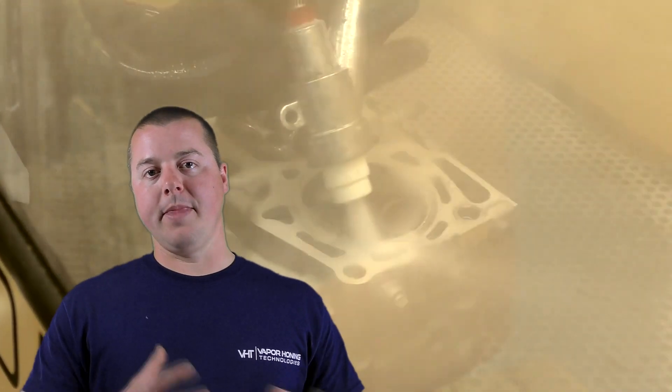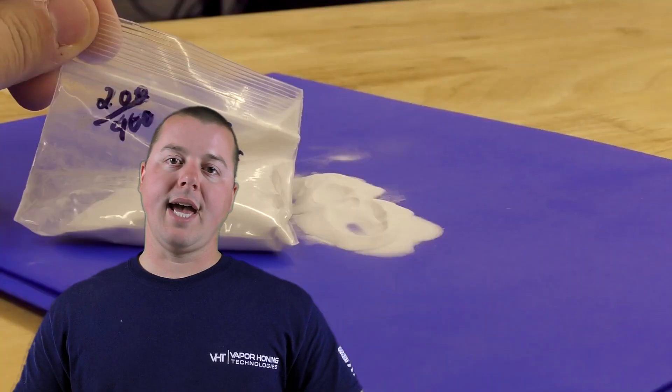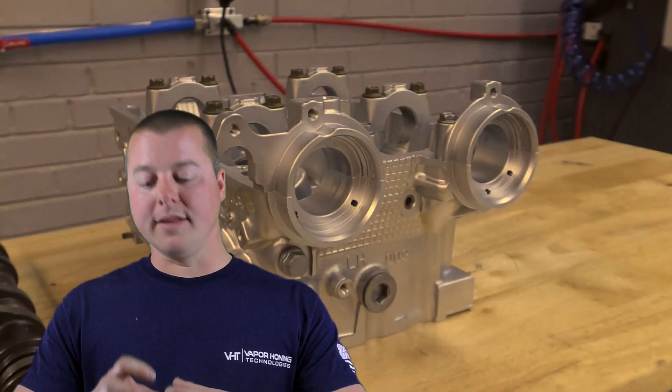The next point is based on the impact of the abrasive. Having less impact on the surface than dry glass bead blasting also means less abrasive embedment into the substrate itself. In the PVD coating industry, it's a very thin film coating and they are very stringent on abrasive embedment. With the anodizing process — essentially staining the aluminum — there's no film thickness, so media embedment causes the anodizing to fish-eye, meaning abrasive is embedded in the part.